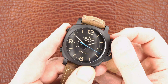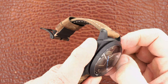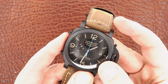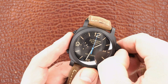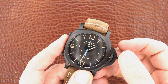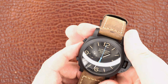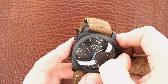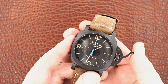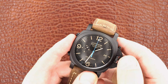I don't know if you noticed it — I'm going to show you again. Watch the seconds hand of the watch. When you set the time, it hacks back so that the seconds hand is at zero. You don't have to wait for it to get around to zero and then pull out the stem to stop it — it literally stays there. See the seconds hand moving. Pull it out to set the minutes and it hacks back. It jumps back to zero and stays there until you close the lever to start the watch.